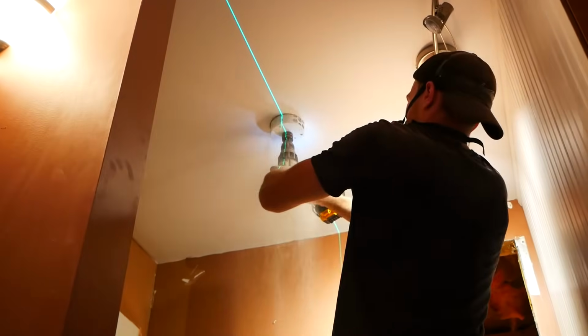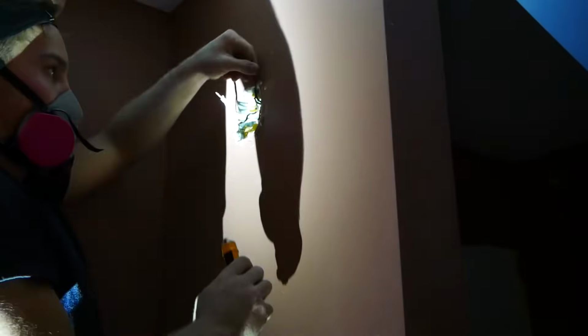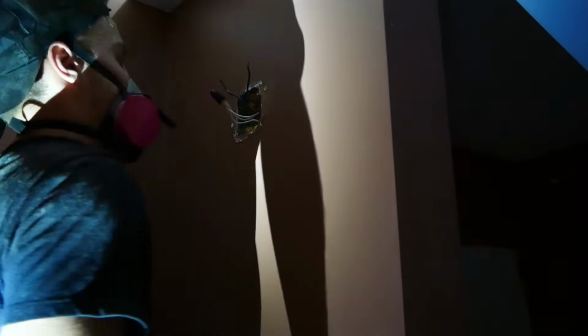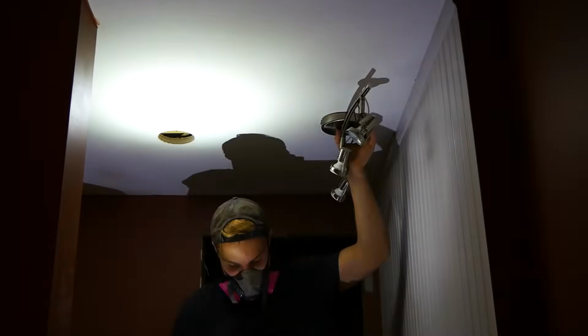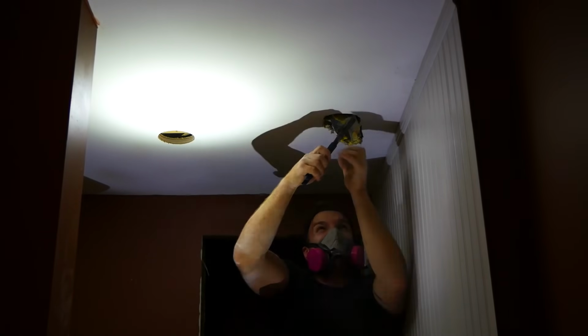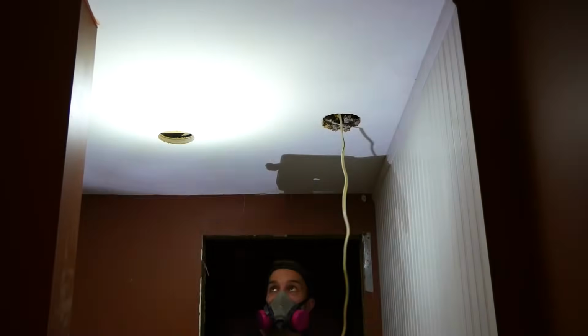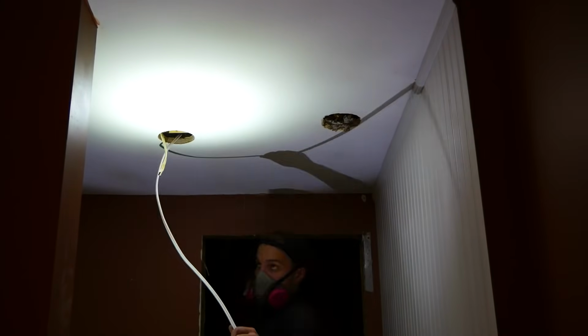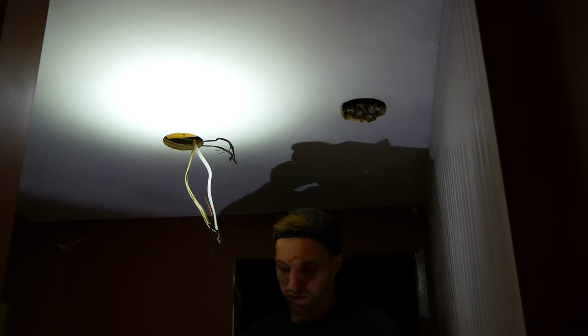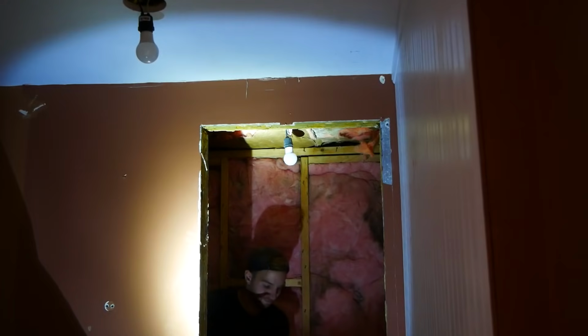At this time, I then decided I'd start running some of my electrical. I did this so that I'd have some real working light. So I drilled out the location of where I'd be putting in my pot lights and ran wires to temporary pigtails. I checked to see how the old fixtures were wired and was able to take one of the lines and reroute it to my pot light. I did this so that I would avoid fishing down into the switches. It's just less work.